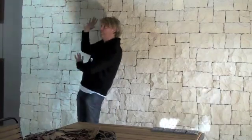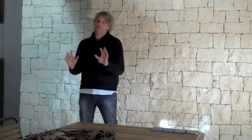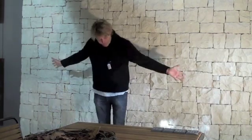This wall took about 4 days in total to do. So really, it's about roughly 22 square metres. So you're almost getting a crate a day for a team of say 2 people, roughly. It might be not quite that, but sort of around 5 square metres per day of this sort of material for a team of 2 is probably about right. But anyway, they work in small quantities.